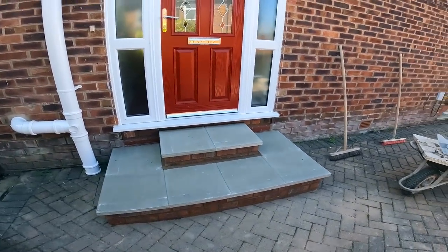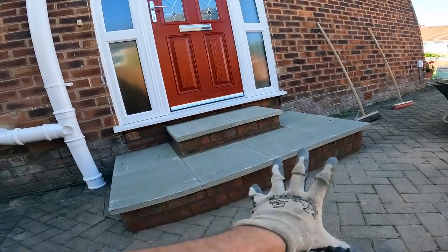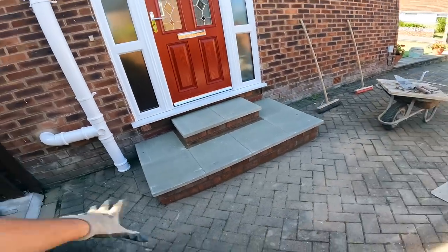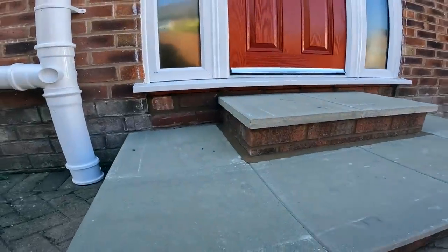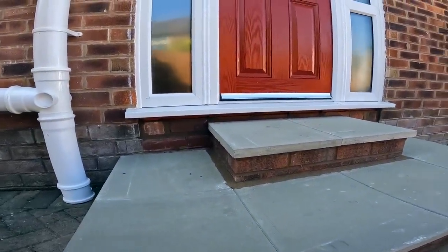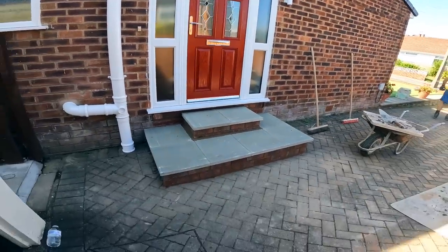And there above it, we have a very decorative set of steps. So you get your two main ones and then you wrap around. Wrap around, yeah. And so all that's left to do now is just have a bit of a clean up, but you don't need to see that. And, oh yeah, and the slab has been put in with Pink Grip, was it? Yes. With Pink Grip, and we've just repointed the crush joints. So there you go. Another set of steps done.